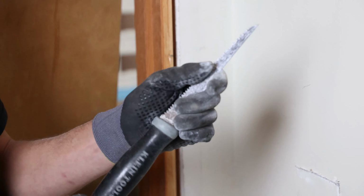Second switch leg is going to my vanity lights, my bathroom vanity lights. See what I'm doing here is I'm uncoiling my wire, taking the twist out. It's gonna pull smoothly. It's gonna look better if I just reverse the twist. So here's the thought. Leaving the 2-gang switch box, the closest vanity light is gonna be a pendant here. Second one is across the bathroom. I'm gonna hit the second one first. I'm gonna take the longer route and double back.